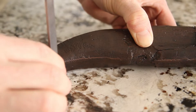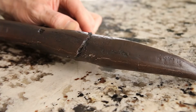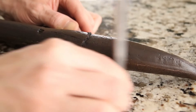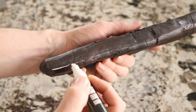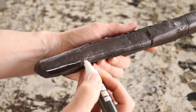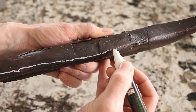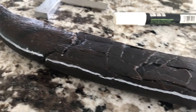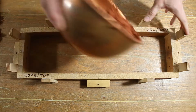The first step in using this tooth to make a bronze copy was to figure out where the parting line will be. The parting line is the dividing line between the two parts of a mold. I used a machinist square to lightly scratch a line on the resin tooth and then traced it with a washable paint marker. Now that I had an idea of where the parting line would be, it was time to make a sand mold.